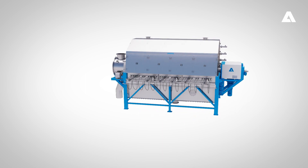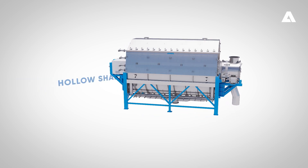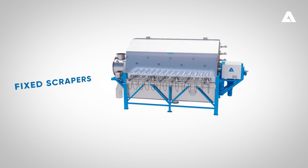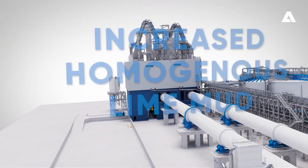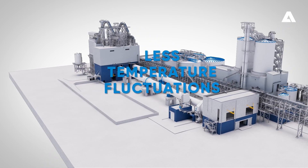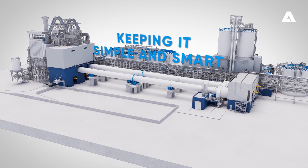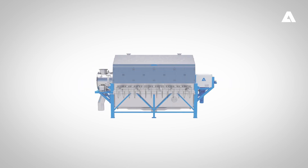The following newly tailored features and concepts are applied: center shaft axial movement, a hollow shaft, and fixed scrapers. The results are a much simplified vat design and a stable feeding system, providing more homogeneous lime mud, which ensures less temperature fluctuation in the flue gases from the lime kiln and ultimately savings in energy. Keeping it simple and smart — Andritz just made lime mud drying easier.